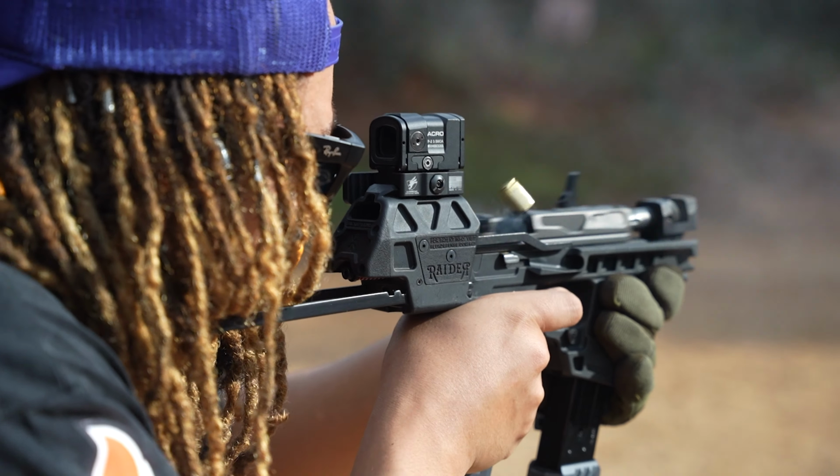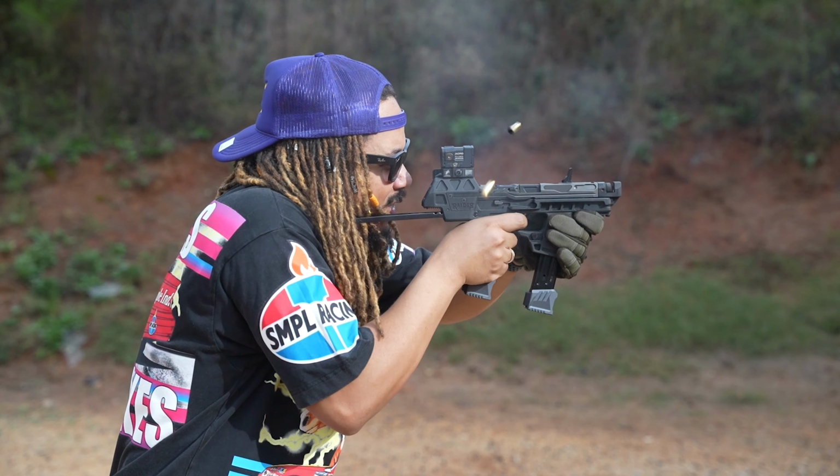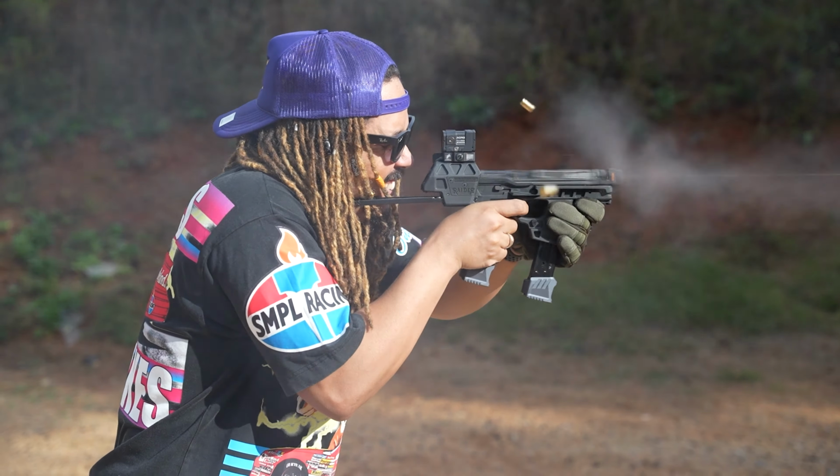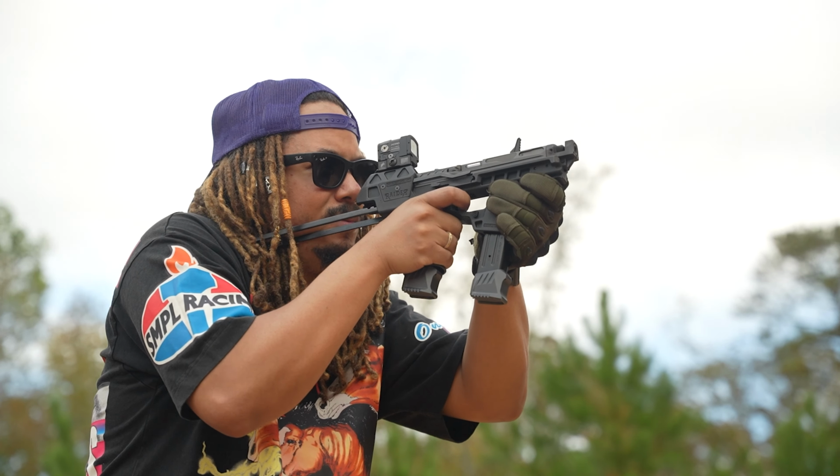So no moving from one cutter to the other or switching or touching anything around that knocks everything off. In one single process, the rifling is made so that everything perfectly aligns, making a very accurate barrel for a very accurate spin on that bullet. Typical barrels you got are usually made from button barrels or the standard cut rifling. Now, I'm not a super engineer in tech, but understanding and seeing the actual cutter itself and understanding a little bit about the process, you can see where having something that is less touched by human is less error, that becomes more precise, and extreme accuracy follows along with that.